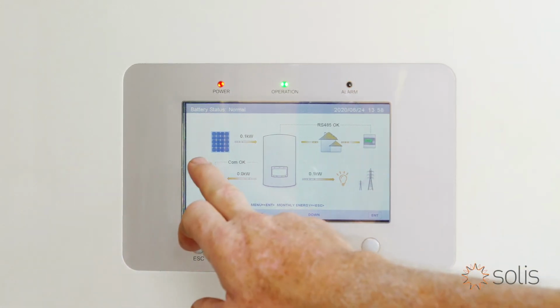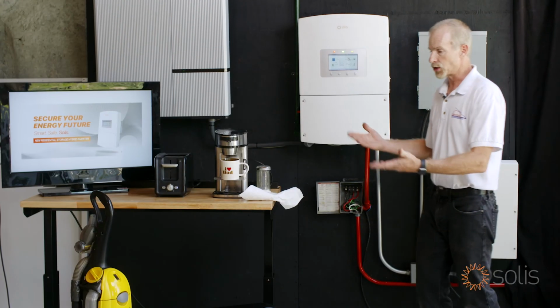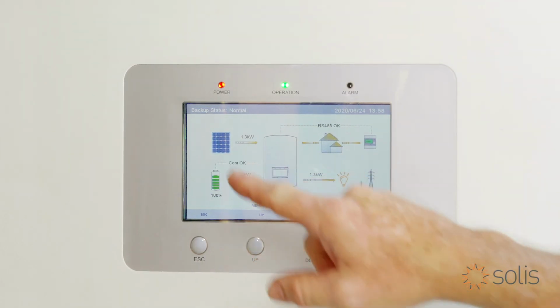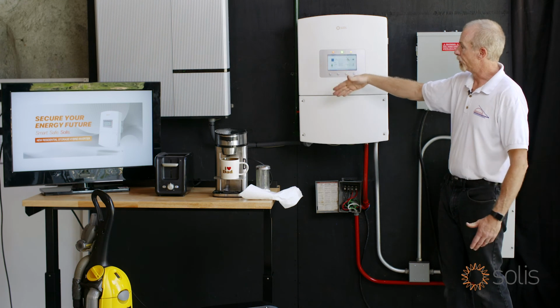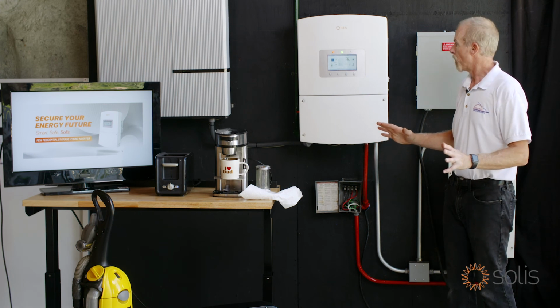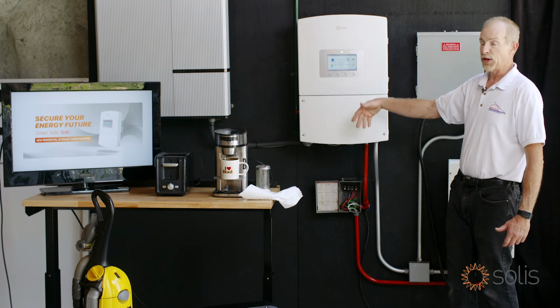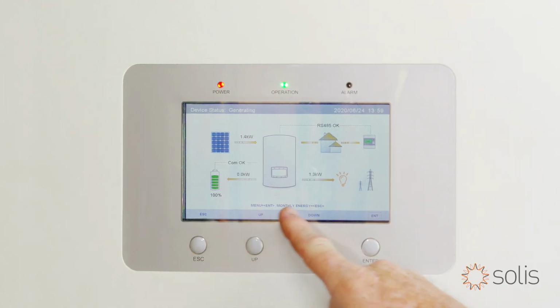Now you're going to see alarm here. The solar is going to go way down because now it's only supplying what we need. All right. The battery is already full, so there's no place to put any of the power. So we can turn on what we want, and what we're going to see, the solar come up because the loads went up. So we can turn things on up to 6 kilowatts right now, and it's free power, 100% free power coming from the sun because the battery's already full, topped off. Now if this was nighttime then the battery would start to deplete. We're going to start pulling power from the battery.